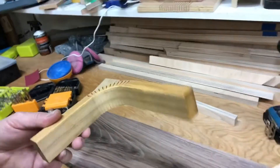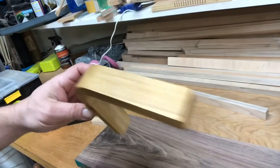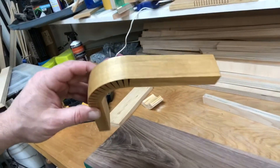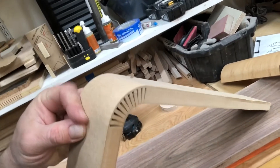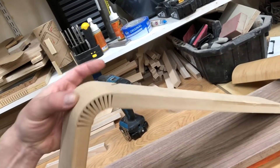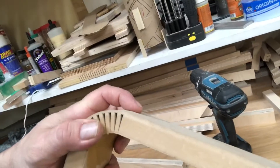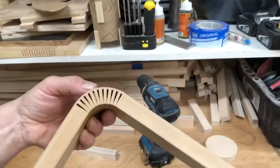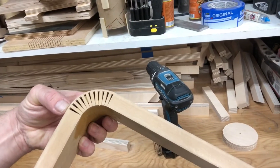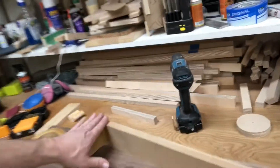This is solid poplar. If you remember my Pretty Persuasions project, a lot of people said you can't kerf solid wood, but it works great — you just gotta bend with the grain. This is some MDF which works, but the surface of the MDF cracks. MDF is really brittle and doesn't bend well, even with really deep cuts. If it's too thick it splits, but thinner it's acceptable — I'm just not gonna be using it. I'm not a big fan of MDF anyway.